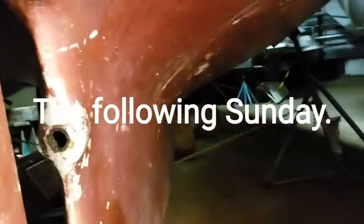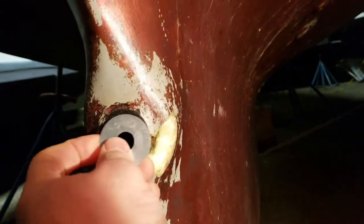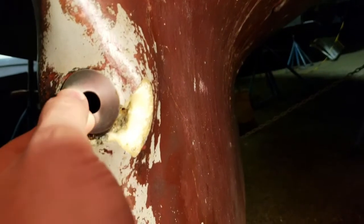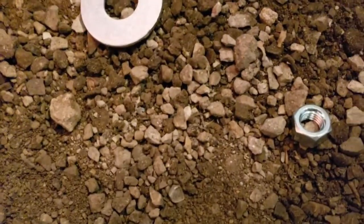I don't want to cut into the fiberglass and the stern tube. So the idea is this: the diameter of the cutlass bearing should be the same on the other side, and that looks like it just barely covers it. I'm going to put that on this screw rod, tighten it down a couple of nuts, and use something slightly larger out here to try to pull it out. That's the plan.